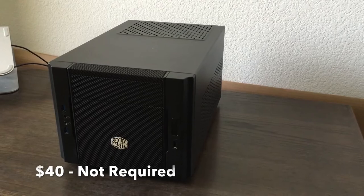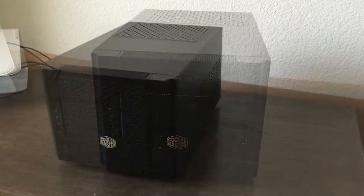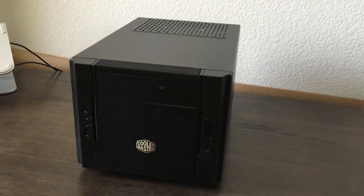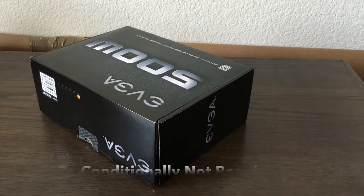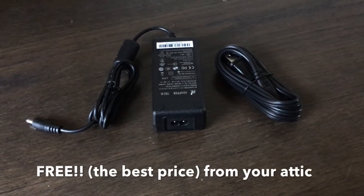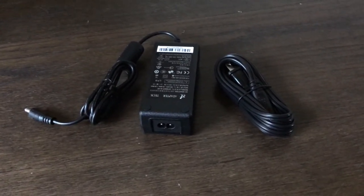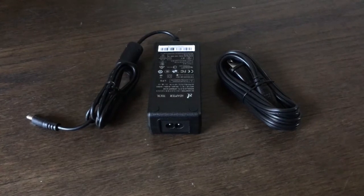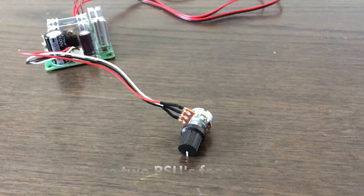Also in the project I got a Cooler Master PC case mini ATX design — you do not need this, I bought it for another project. You also need a power supply. I got an EVGA 500 watt power supply, but you can use anything. This 12 volt, 5 amp power supply produces 60 watts, and each Peltier cooler requires 60 watts, so two of these would work just fine.